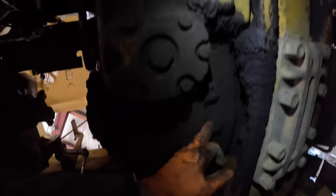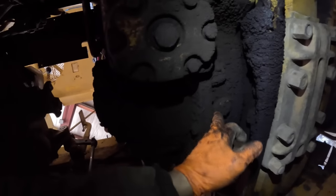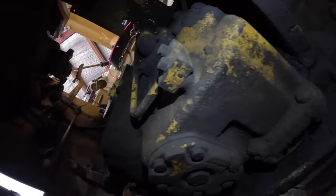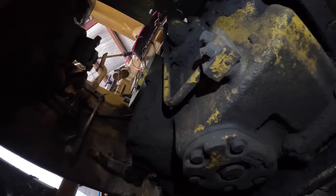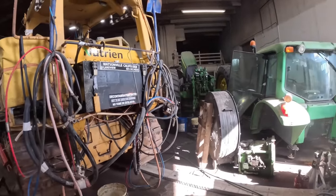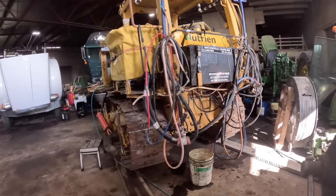What is that? I remember it's like 1 1/16 or something, or 1 1/8. Drain the oil out of that and then start pulling all these bolts. Put a couple forcing bolts in it, but we'll get the old chain hoist out there and rig up some lifting eyes where that inspection plate hole is and hold it. And we'll just let it down here on the ground and then just drag it out from underneath it. Okay, let's dump the oil on this clutch.